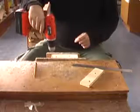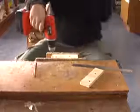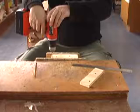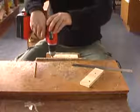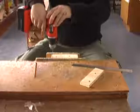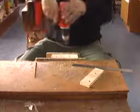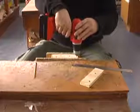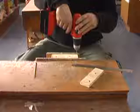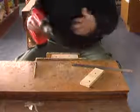When you're doing your drilling, make sure it's nice and straight. I don't want any dodgy holes going sideways, because otherwise the nail will go through and punch outside and it'll look silly. So drill in under power, drill out under power. And repeat with the other one.